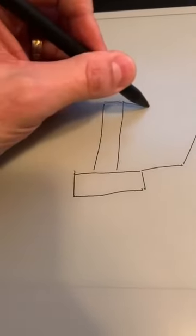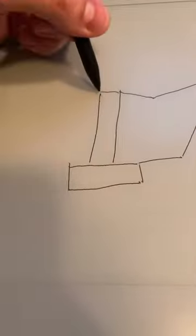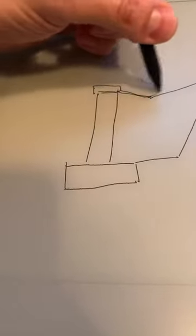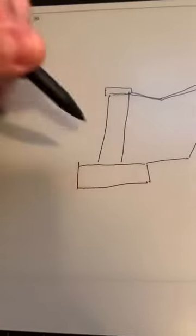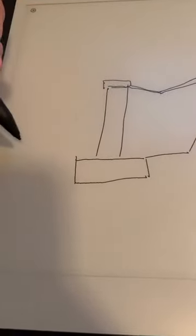I've got my pitch behind the wall to get water away. That's a low permeability fill. Got my cap here, extra layer, boom. This is my base. So can this base be the same base as my pavement?